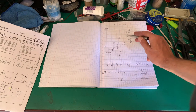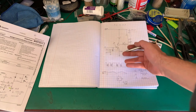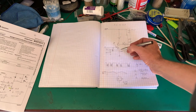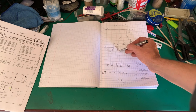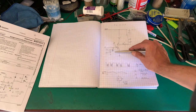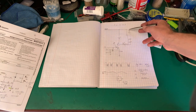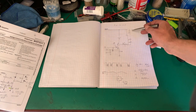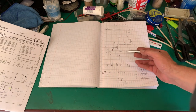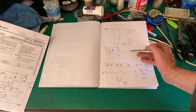Remember, we said all things being equal, that is off, no current is flowing. When that switch is on, the current will flow through the inductor, through the FET, through that current sensing resistor down to ground. The voltage will build up here because V equals IR, Ohm's law. So the voltage across that resistor will build up. It will drive the current sense pin of the IC that is controlling this, and it will know whether it should switch more or less. Also, it will know if one of these LEDs is shorted out, we'll have more current, we'll have less voltage, more volt drop appearing here, so it's a protection pin as well. I'm going to give you the data sheet so that you can look at this at your leisure. I don't want to spend too much time on it.